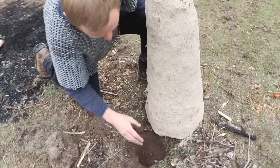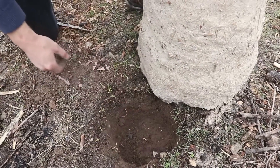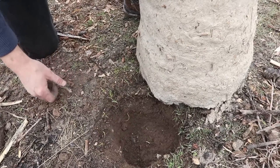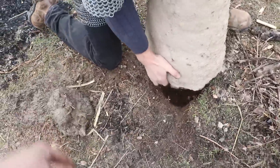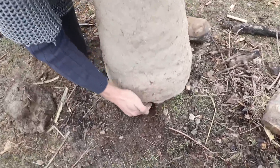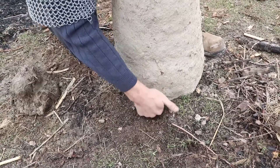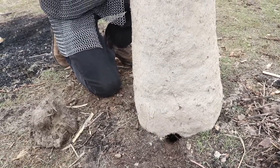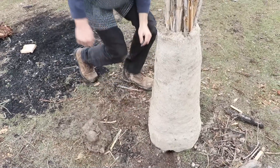We've got the hole right here. You want some space between the air supply and the bottom — you're not burning away your iron. Exactly, you want a little lake of fire and brimstone down here of silica. I'm just going to roll this back into place. Are you going to seal it with clay or just its own weight? Mostly its own weight should do it, especially with how wet our soil is right now. Now all we need to do is set this form on fire and clean up the edges.